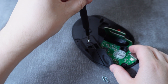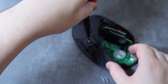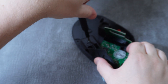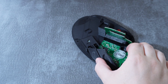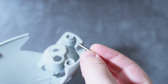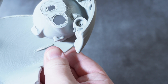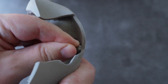Seriously, do not over-tighten these screws or you will break the base. Grab the right buttons and lay them in the square in the base. Insert a screw and slowly and gently screw it down, whilst also rotating the buttons gently toward the PCB as you go — this will ensure that they're positioned correctly. I tend to err on the side of leaving the screw a little bit looser. Next, fit the scroll wheel dowel into its hole in the top shell by inserting the metal dowel and wiggling it around to loosen the hole, ensuring a good fit when you assemble it later. You can then set the top shell aside.